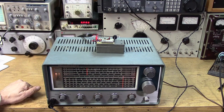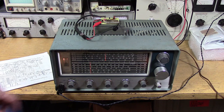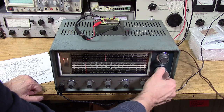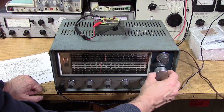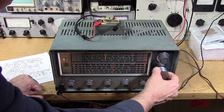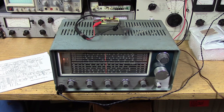That's not normally the way you use it with a receiver like this. The more typical way is to make sure you're not going outside the band edge. In this case, 40 meters down here is where the band edge is. We're just trying to make sure we're not going outside the edge. If we did our calibration right, we should be seeing another blip up here at 7.1 MHz. So every 100 kHz you're going to see a blip.